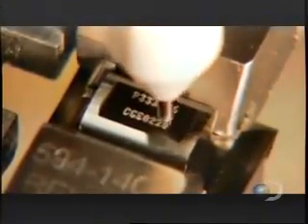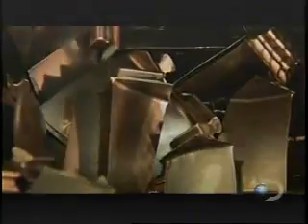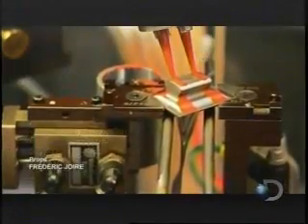A dot matrix machine punches identification numbers onto the blade. Next, the blades are submerged in a fluid that penetrates any flaws in the metal. This inspection is critical, because even the tiniest nick can spell disaster when a jet's engines are working at full speed. Inspectors examine the blades under a blacklight — a perfect blade shows no marks, but spots of fluorescence indicate microscopic cracks and weaknesses, and that blade gets rejected. The dovetail gets two strips of rubber silicone that ensure an airtight seal when the dovetail slides into the slot on the compressor drum. A final check, and the blades are now ready for takeoff.